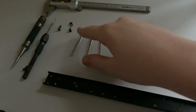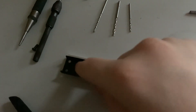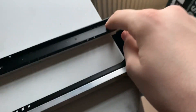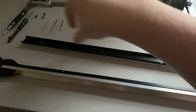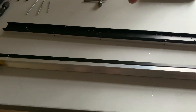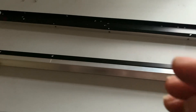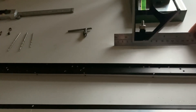Another thing I'd recommend is just have two M3 nuts and M3 bolts. The way I do it is: I'll drill a hole at this end and a hole at this end first, and put those in. It basically locks the template onto the old one so that when you're drilling they won't move around as much, and it's easy to mark everything out properly.